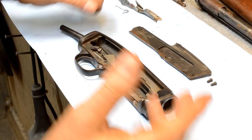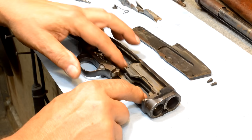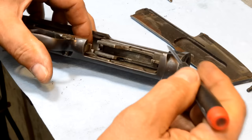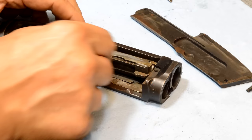What I want to know is, when the breech locks, the bolt locks up into that recess in the top here, and what I would like to know is how to unlock that. What is keeping that locked in? That lock right there, ordinarily the action bar would come in and trip it. But that lock will pick up, and then the bolt can be pivoted down. And when the bolt is pivoted down, it's allowed to come to the rear, and we should be able to get it through this morass and take it out.